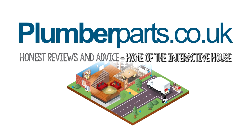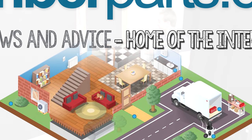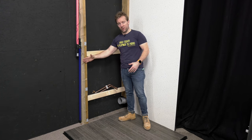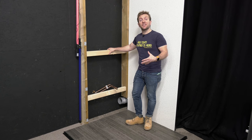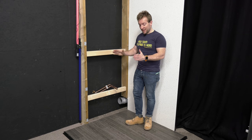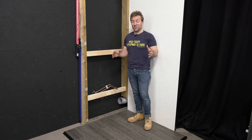Remember, you can learn more about bidets and the plumbing in your own home by visiting our interactive house. So then, first things first, I'll pop these noggins in purely for the descriptive part of this video. Just imagine that this is a brick wall here. You could actually use this piece of equipment and fix it directly onto studs like you have here, but why would you do that if you could conceal the cistern and gain yourself that much toilet space, especially if you've got a small cramped bathroom?